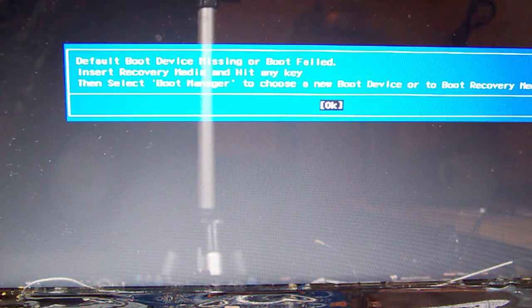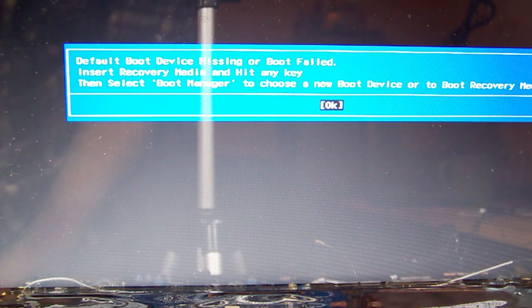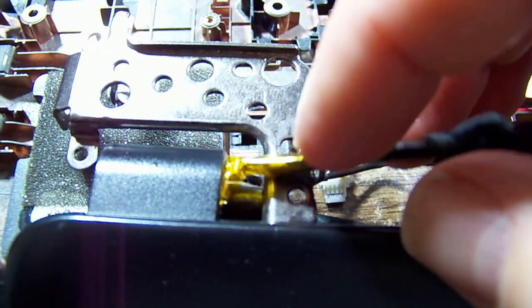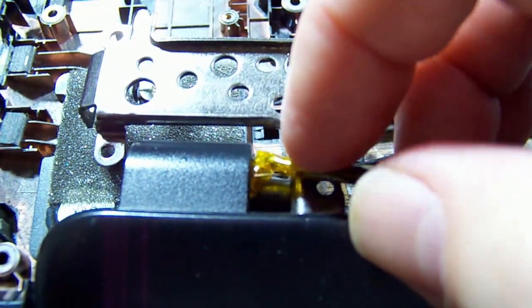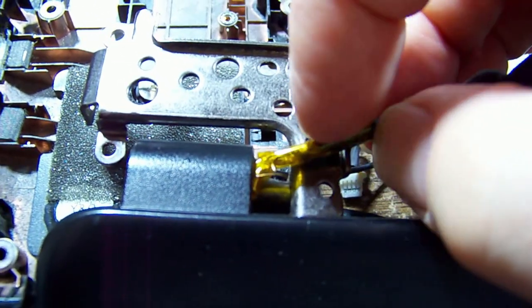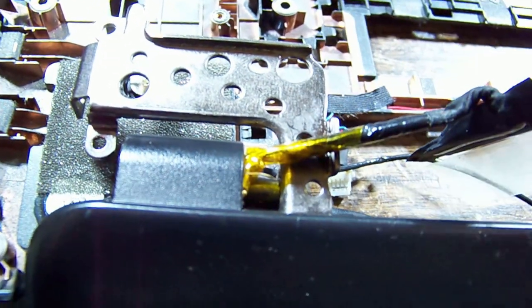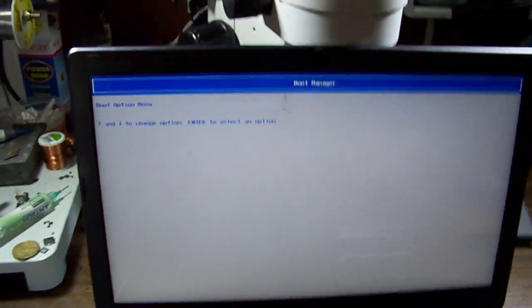Already ready to go. Hit the power button with a set of tweezers - I'm just bridging the contacts on the connector, I don't have the thing fully plugged in. There we go! It's not the first time I've seen a broken cable. Let's wrap all that up, make it nicely insulated, and put it all back together. I ended up wrapping it in Kapton tape because it's really thin so you get more flexibility than insulation tape. Kapton tape is also nice and sticky so it shouldn't unravel.